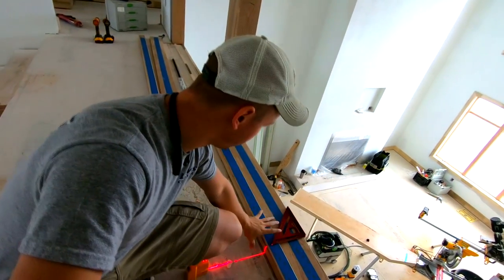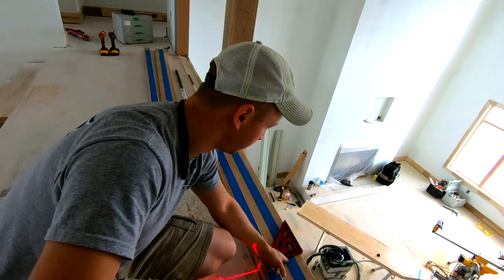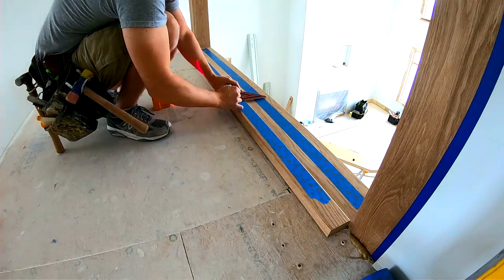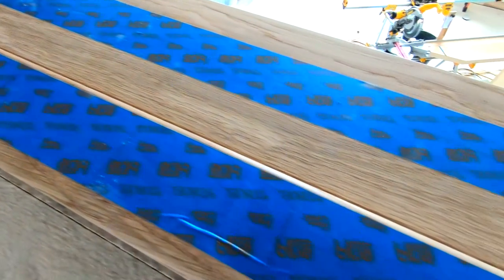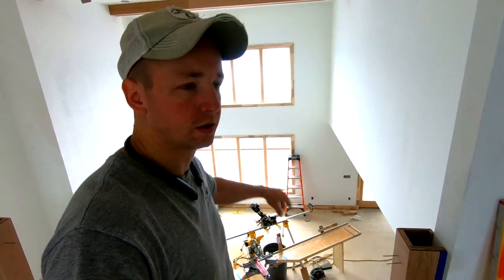You can see here I've taken down the handrail, flipped it over, and set it right down into place. I'm using my square to line up the center on the handrail and the center on the shoerail, then working both ways marking with my square. At this point all the baluster locations are marked out on both pieces, and I'm going to take them down to the mortiser and mortise out all these square holes.